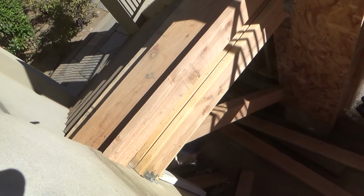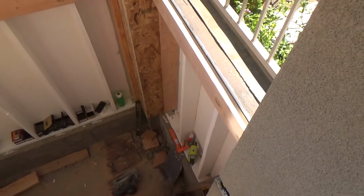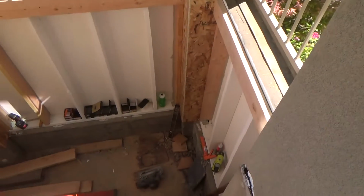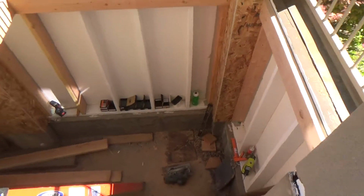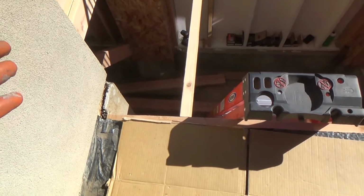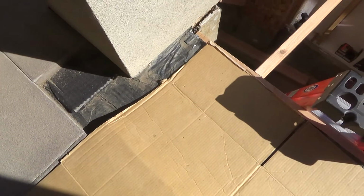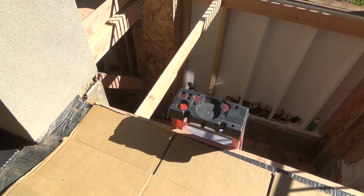then I have to measure from there to nothing, cut that off, and now all of a sudden my joist that I've already nailed in with joist hanger nails and stuff, I've got to move that over because it's not hitting now, or I have to put a scab on the side of it or trim it off if it's going over or whatever. So that's the reason why we need to figure this out, okay? And here's my trick to figure this out, that I can measure this and know that it's square with just my tape measure.